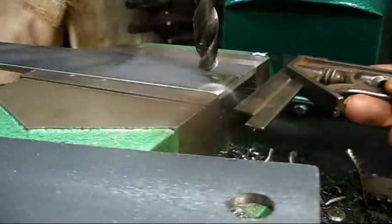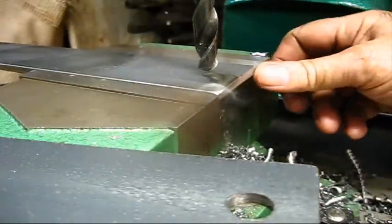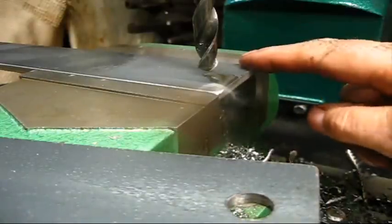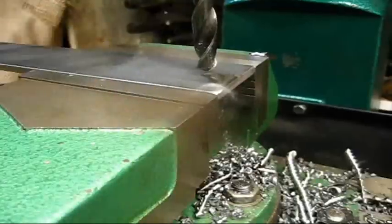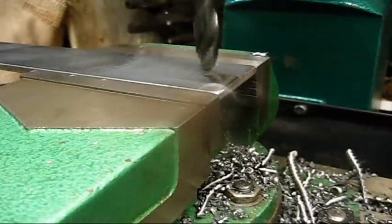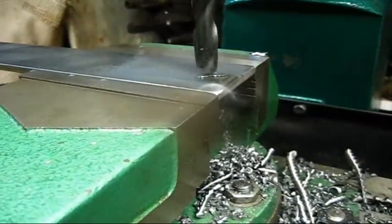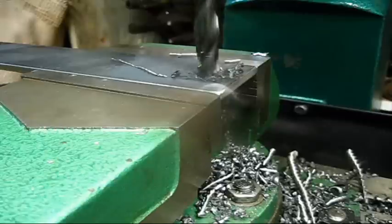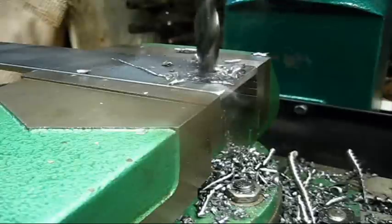All I do is put the piece of metal in the vise, put the straight edge across this way, I just use a thumbnail, and when those two are even, then you know if you repeat that, then that hole will always be in the same position, no matter how many pieces you drill. I do have a little cutting oil there. It's a half inch hole I am drilling, it's a loose fit for the bolt. I needed some alignment variations in the mating hole, so I did decide to put a half inch hole here.